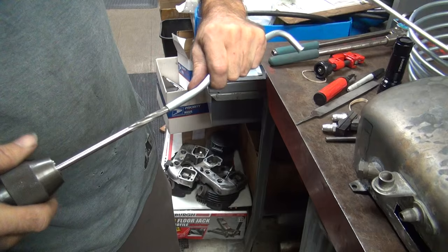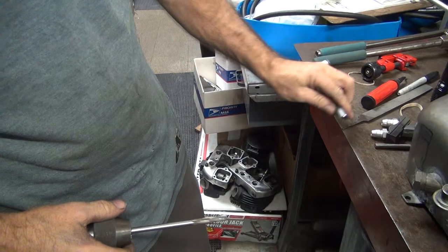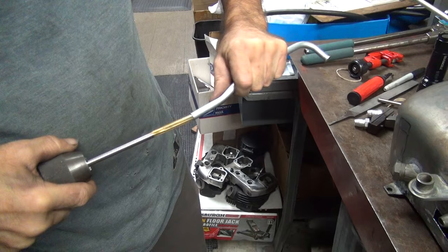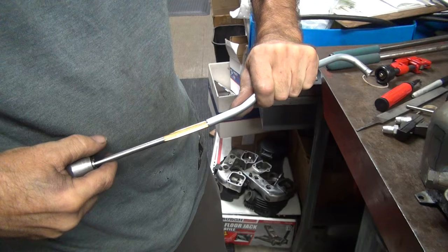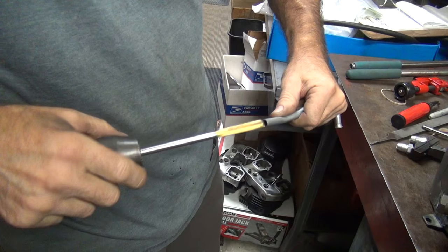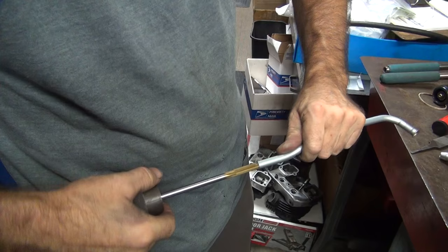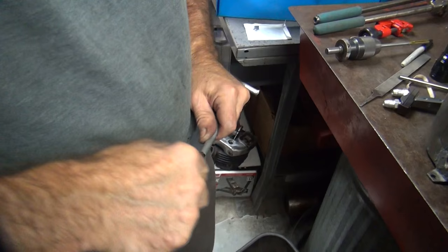Have to step it. Stage 1. Stage 2. I think this is a 5/16 reamer. Now, if you use power tools, it might go quicker, but it also might wrap you in the wrist a couple times. And then all your precision bends would be for nothing. Uh-oh, it appears that it's going in. So that was stage 2, and then the final stage is deburring. What about filing? All right, so this would be stage 3. Internal deburring, and then we'll do some external deburring.